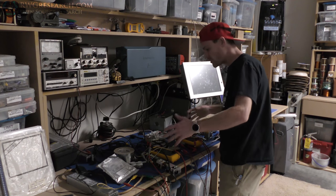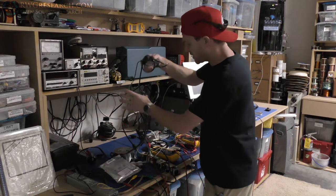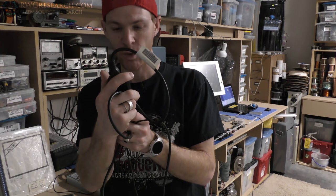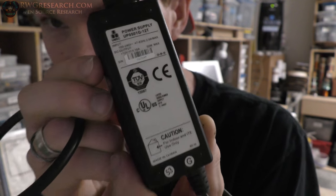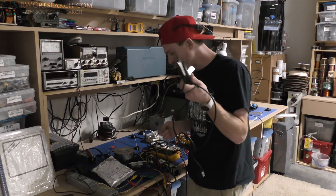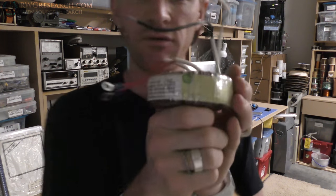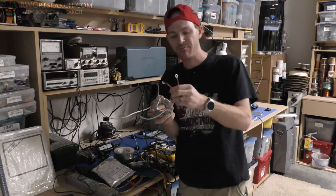I'm going to run through a few power supply options using things I've dug out of the bins in my shop. First is a regular brick power supply — these are Allen Bradley supplies, 50 watt, 4.16 amps at 12 volts. However, 4.16 amps isn't enough and you'd have to double them up. The second option is a toroidal 12 volt power supply designed for halogen lighting — 120 volt in, 12 volt AC out, rated around 6.75 to 9 amps. That would work, but since it's AC output I'd have to rectify it.